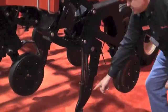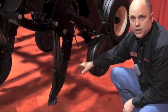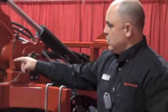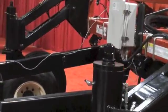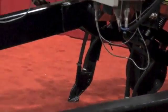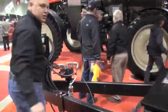There's a close distance between the tip of the opener and the packer wheel, so it performs well in trash — residue flows around nicely — and at the same time, there's enough distance for soil to flow back around the opener before the packer wheel hits it. What makes this drill different is the gauge wheel on the front, which is part of the control system. It reads the contour of the ground and how hard or soft the ground is. We have a potentiometer on the linkage of the gauge wheel and a potentiometer on the linkage of the live opener beside it, allowing you to control seed placement right from the cab of the tractor.